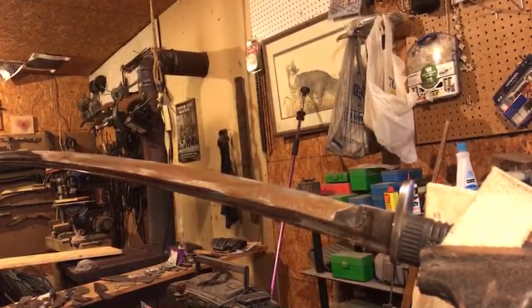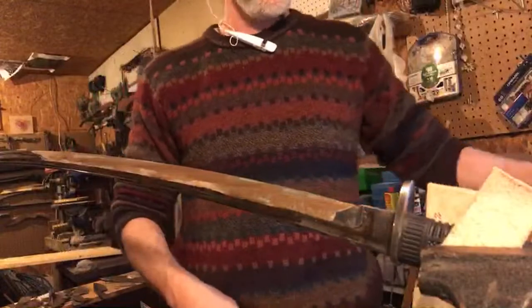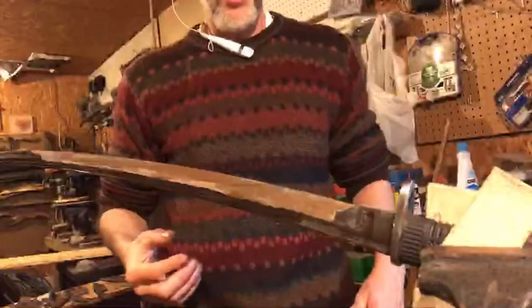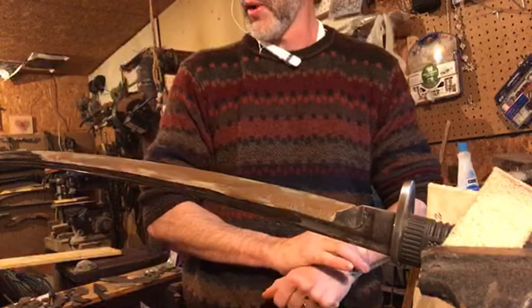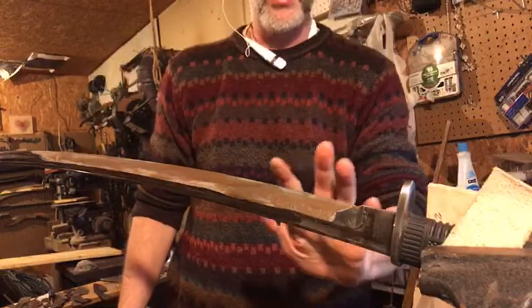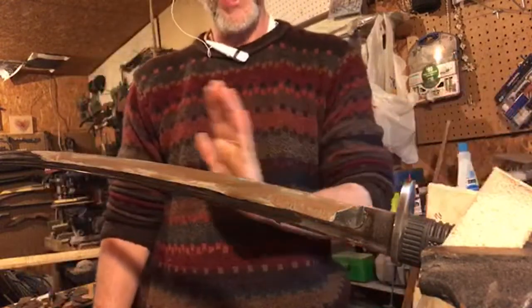So pretty soon I'm going to put my armored glove on. We're going to do just a little bit more grinding, and then I'm going to put my knife cut-proof gloves on, because basically what's happened at this point, pun intended, is that we've curled that burr edge over. I've illustrated all that on the whiteboard already. You can feel it on this back side. There's a little bit of a burr edge. So now we're going to come back on the opposite side and flatten off and polish.